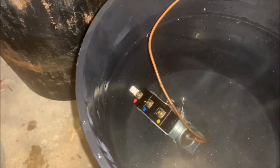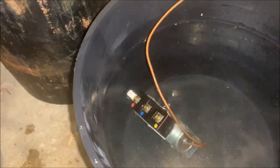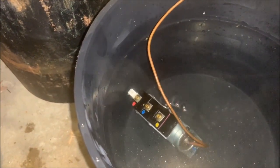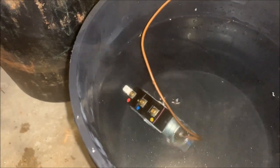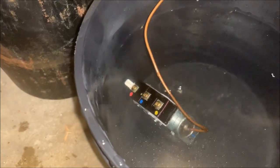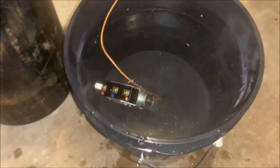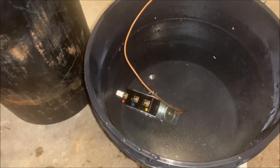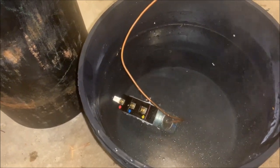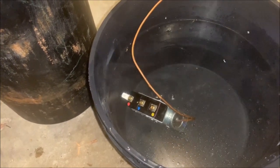If I hadn't got the hit with the H10, honestly I probably would have messed with it a little longer — I probably would have had to put it in operation and actually see it happen. Luckily the H10 picked up the leak. So I verified that's where the leak was coming from and I didn't spend much more time trying to figure it out. I thought it was just an interesting little tidbit and wanted to share it — if you didn't know it, you learned something.